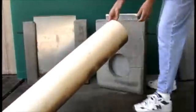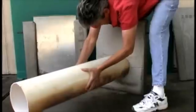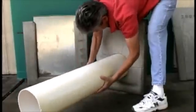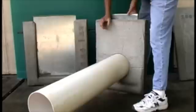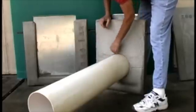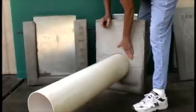This is an 8-inch section of pipe. Once you get your gates fitted into place in the irrigation ditch, you just take your pipe and fit it in the enclosure. It always fits good and tight — you hear it hit the front enclosure and the slide. You come back and seal around this opening with asphalt roofing tar, which makes a nice tight seal.